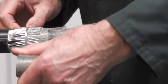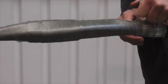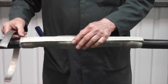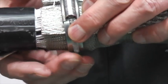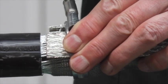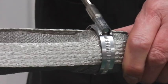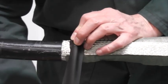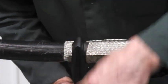Now apply the tinned copper mesh from the armour wires on one side to the armour wires on the other side and temporarily secure. Position the main copper earth strap or straps depending on the cable size. When using the clamps provided, tighten these up to give a firm earth point. Apply the low halogen EPR tape around the clamp buckle and any sharp points.